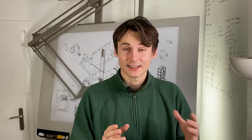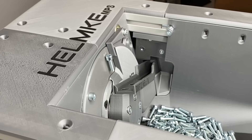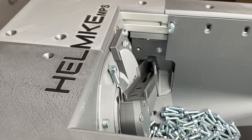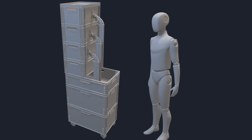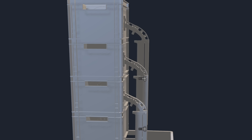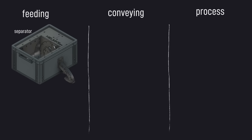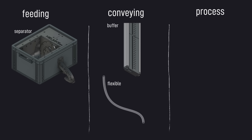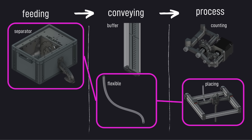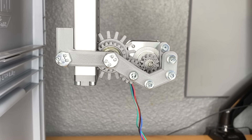For everyone who has not seen the last video, here's a quick recap. Over the last years, I had to manually count and package thousands of different screws, nuts and washers for 3D printed parts that I sell online, so I built a machine to do that for me. This video series is about the development of components using 3D printing, PCB design and some of my personal design theories. The parts travel from the separator via the buffer magazine to the dispenser, where they stick up. The production system is intended for various automations. We built 3 kinds of modules — the tube is flexible, the magazine can function as a buffer — all feeding screws, nuts and washers through a sequence of modules. The goal is not to build the most specialized machine for each problem, but to develop a pool of automation modules that can be combined flexibly.